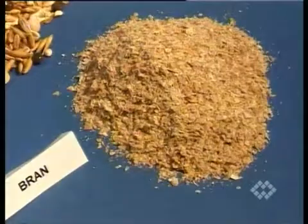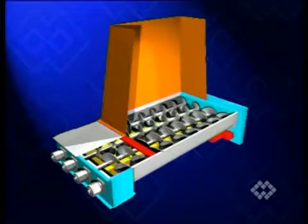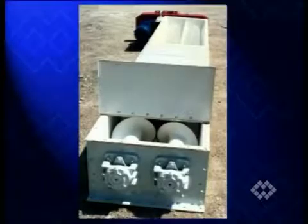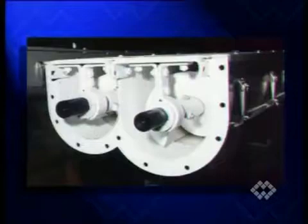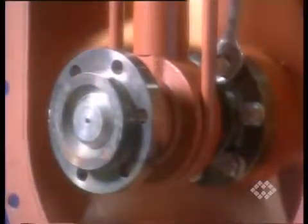For more difficult materials, a wider cross-section of the silo outlet and the feeder inlet is required. In such cases, twin-shaft screw feeders are the right solution. Like the single-shaft types, twin-shaft feeders are available in light and heavy duties, and for certain types of continuous operation are also available in extra heavy duty.